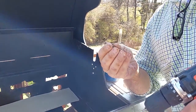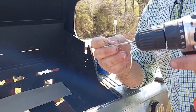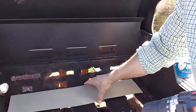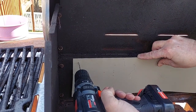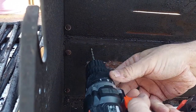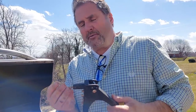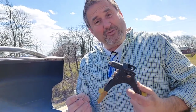What you want to use is a pop rivet — it doesn't matter what size, but I happen to have eighth inch ones here. You want a drill bit just a trifle bit bigger so it can make a hole for the rivet to go in. Let's get in here and drill this first hole right here. Now we've got the first hole drilled.